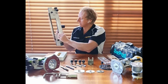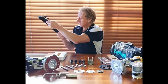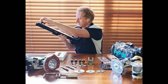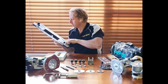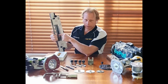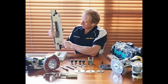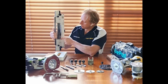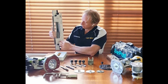So whether you're doing cylinder and spindle holes, or you want to do flush pull cutouts, that's how you do it. We have markings here and here, which is for your door thickness. So at the moment I'll set the rail for a 40mm door, and it's easier to set up on the door once it's clamped on. That's on a 40mm mark in there. So with lock face plates, it's always centered 25 from the edge, and that allows you to work off this reference mark here. So if it's a 40mm door, which you've got it set up there, and 20 would be your center, so you line that up.